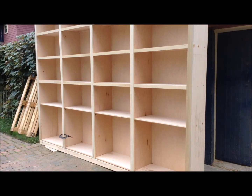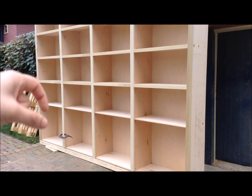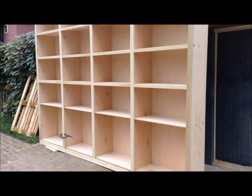All those middle rails in place, I'm going to start framing out the cabinet and the tops. And the cabinets, I'm going to do 2.5 rails, and the tops I'm either going to do 2.5 or 3. So I'm going to rip more poplar down on my table saw and trim them and start fitting them just like the middle rails.